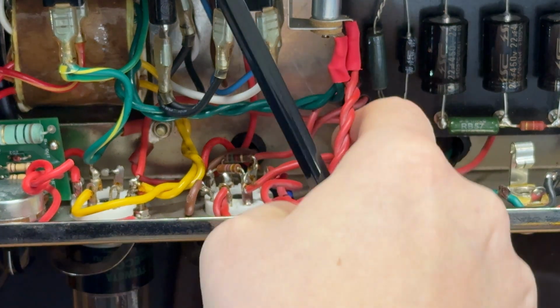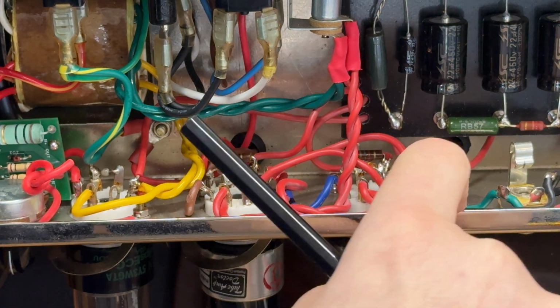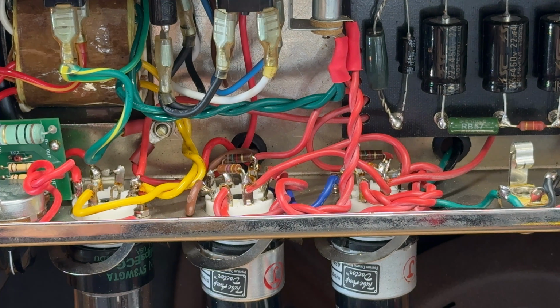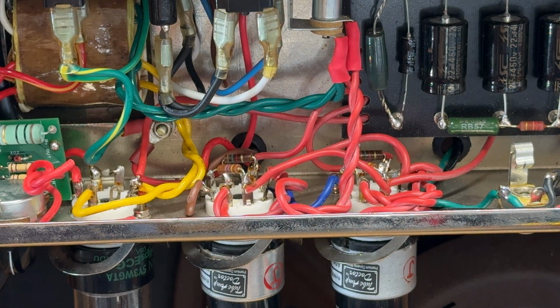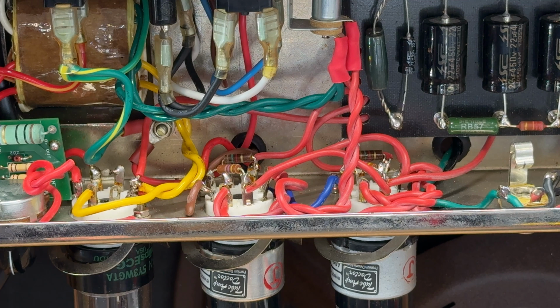It just means that he's got these extra long wires that didn't need to be there like that. But at least he's got those resistors in. I mean, those 470 ohms really should be at least 1 watt as a minimum. But it's not the end of the world. We'll get you some more light in there, shall we?